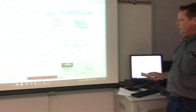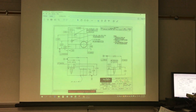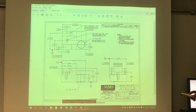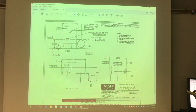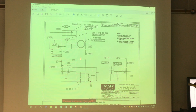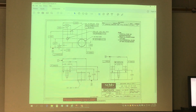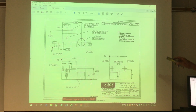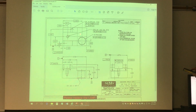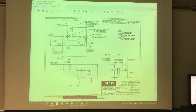To start with a part overview — this is NIMS job duty 2.5 and 2.6, which we call the step block. It's two and a half inches long, inch and seven-eighths wide, and inch and three-eighths high. All we're going to be doing today is showing you the features that have to be stepped in here.